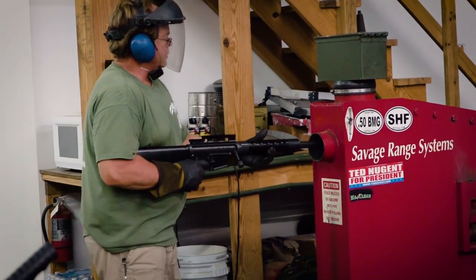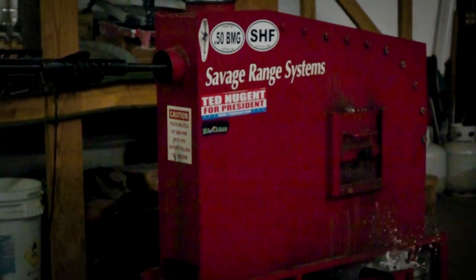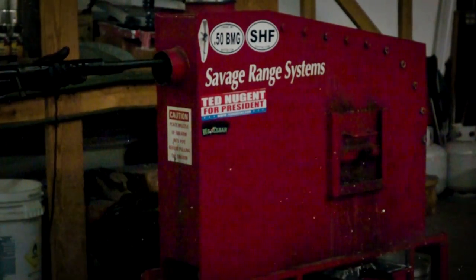They'll be parkerized, and once the parkerizing is done, final assembly takes place. We check for headspace again, assemble the parts, and the uppers — depending on how it's ordered — get test fired. Typically in the shop we just shoot one round. I can usually tell if the gun's not going to function correctly from that one round — whether it won't go off or won't extract. If there are any issues, it might go two, three, or four rounds to figure out what's going on, but on average it gets one. After test fire, we check headspace again to make sure nothing's moved or changed since we did it initially. Then it's packed up and shipped.